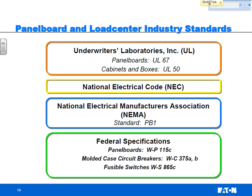NEC, the National Electrical Code, doesn't have any bearing on how we put together our product. It is a code about how that product is installed. So NEC is an installation code. UL is more like a manufacturer's code. Now, granted, we understand the NEC is driving how this is going to be installed, so we do consider that when we make our design to make sure we're not putting something in that's going to violate the NEC if it's installed properly.